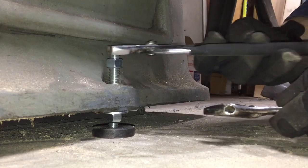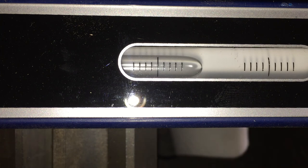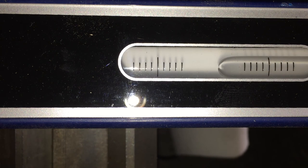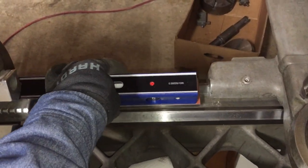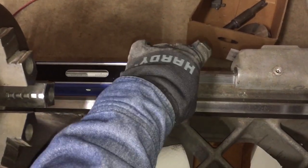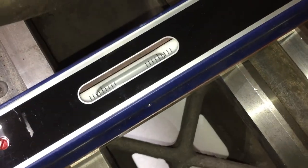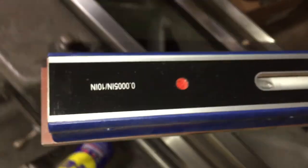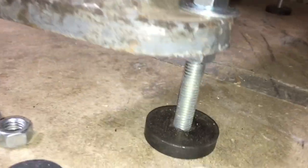You can see how the cherry-picker legs deflect — you can imagine just how heavy this machine is. Trust me, I had a blast moving it into the garage. Then we adjust the nuts to get our machine level. This is a very tedious process requiring a lot of going back and forth from one leg to another; even a tenth of a turn or less makes a big difference. This is a precision machinist level able to detect half a thousandth of an inch per ten-inch span. After about 40 minutes of crawling on my knees adjusting one leg at a time I achieved this level of precision, which I'd say is not bad at all. After adjustments, the difference between the longest and shortest leg was about two inches.